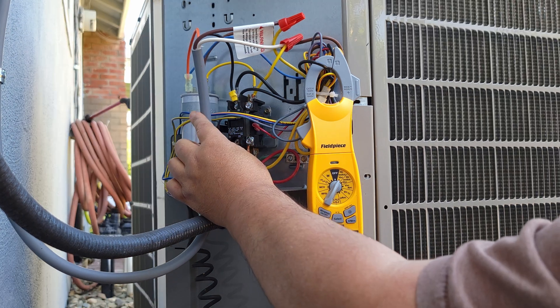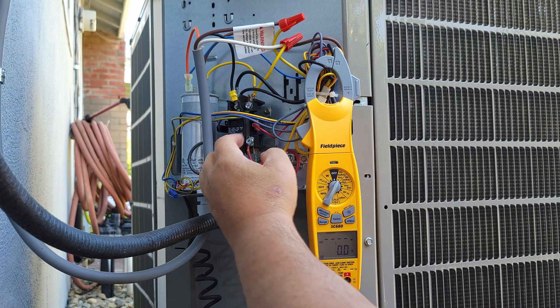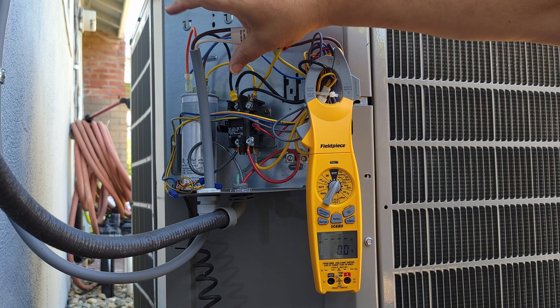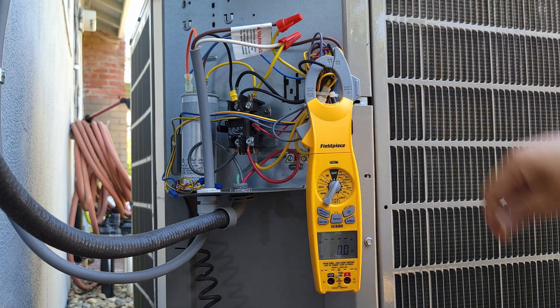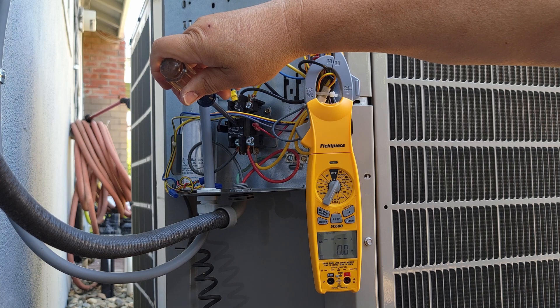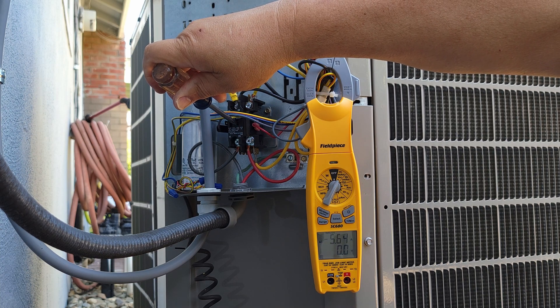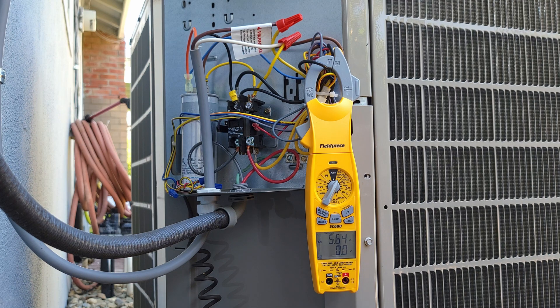All right, the wiring is done. The orange wire goes to the hermetic side of the capacitor, the black wire is connected under the screw head, and the brown and white wires are spliced into the yellow wire — the white leading into the contactor and the brown going to the windings. Let's go ahead, give it a shot, see if it works. Wow — six amps! That's quite a big difference from the 93 amps we had before the Easy Start was installed.